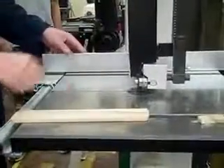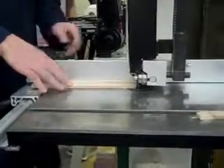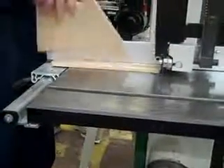When you are going to go and use the fence, you can bring the fence over — and you see that's too small. So that's going to get blocked because you are going to need to have your push stick here, and the push stick is going to get blocked. So just like the table saw, you are going to need to use the push stick so your fingers don't get close as you are running the wood through. Does that make sense?